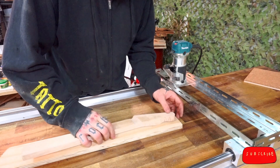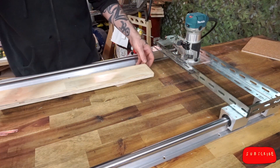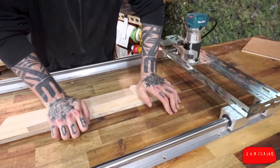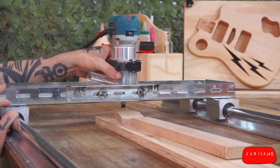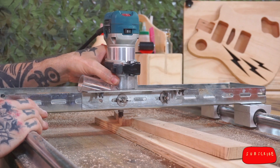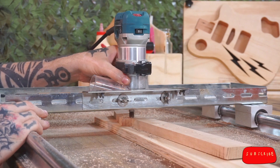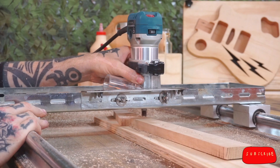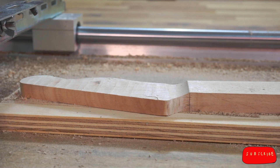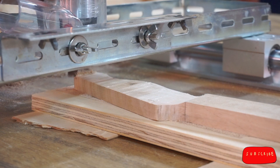To test the setup, I used the neck we transitioned in Episode 6, and I double-sided taped it to a piece of scrap I'm using as a riser. I stick the neck to the riser and the riser to the bench top. Once I've set the bit depth to where I want it, I just start routing. The tape didn't hold as well as I'd hoped, so I guess I better make a base for this thing at some stage. If you had your neck or body clamped down properly, you could hit it a lot harder with the router. But I'm taking careful bites. I'm also not using the right router bit for this — I should be using a face milling bit. This is after the first pass, and I can see there is some flex in the gantry, so I'm going to take the advice I gave you earlier and stiffen it up with some extra metal.